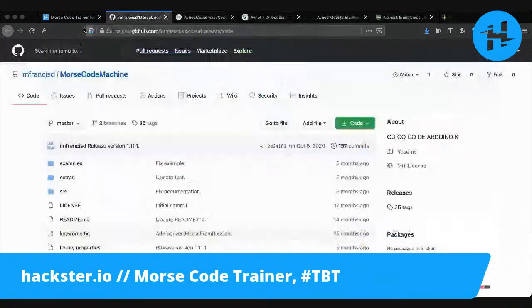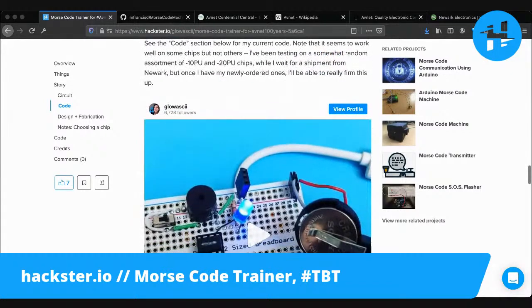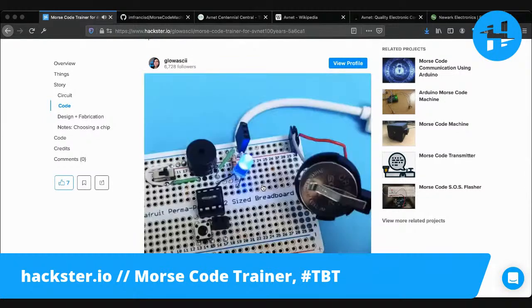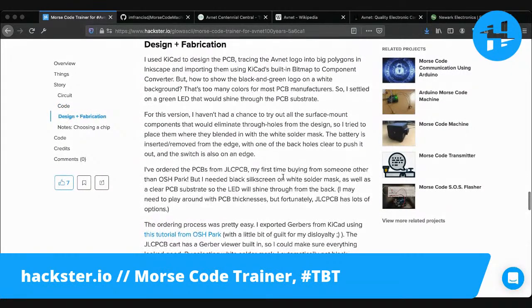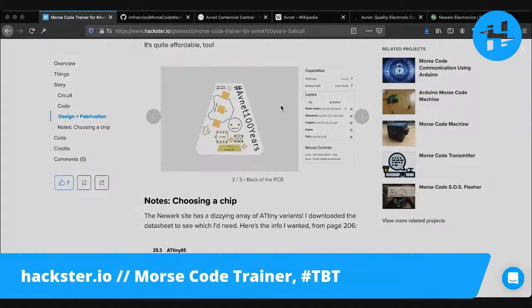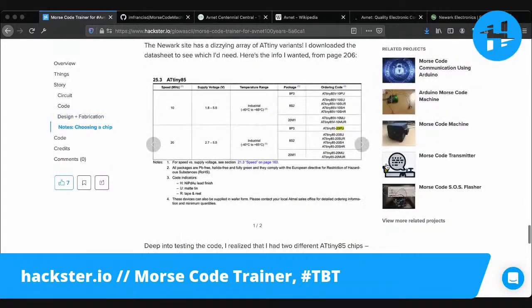Really a pain. But if you look at the tutorial, I have put together all of my findings, as well as given you the code that I used, so that you can have a better experience than I did - and that, in my opinion, is what Hackster is all about. You can find a demo of it working and being a little louder on the protoboard demo unit prototype, and then some notes about design and fabrication using KiCad to design it and things like that. You can see the previews on JLCPCB - I wish I had noticed them. They even put little slight beige lines to show you where the connectors are going to be underneath the solder mask, and I did not notice those details.